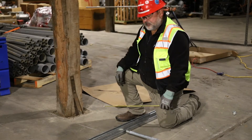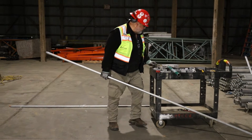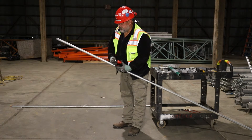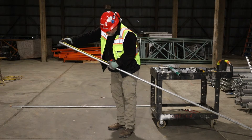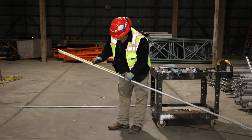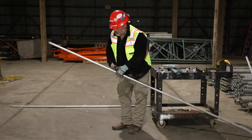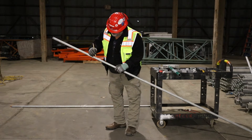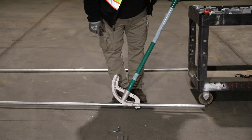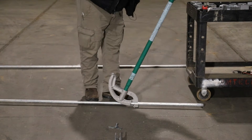We're going to have to measure up and cut that off as a secondary piece. The first part is a 32-inch 90. We're going to deduct the eight as we did before. 32 inches compensating for our five threads, minus eight, comes to 24 inches. Or, overhanging eight inches, they still come up to 32 inches. We'll mark that all the way around the pipe and we're going to bend it. We've got the arrow lined up with our mark — the mark is at 24 inches, which is 32 minus 8.